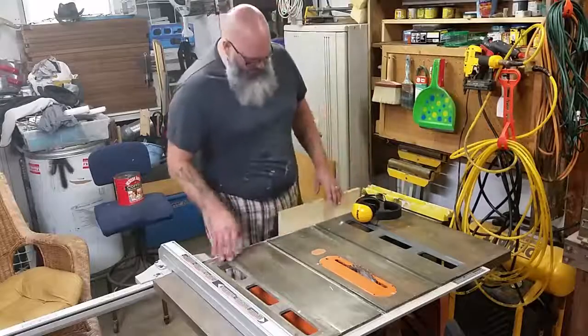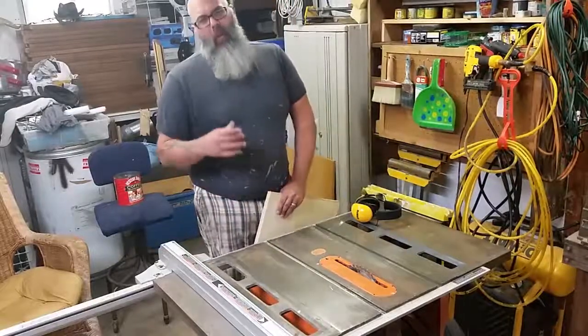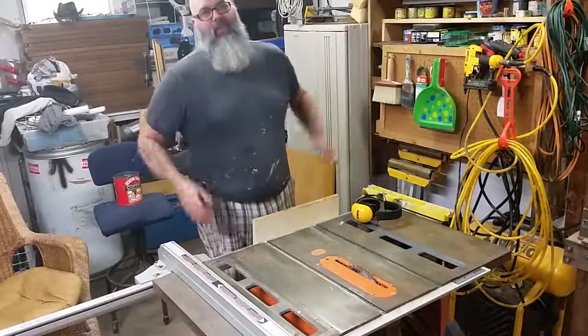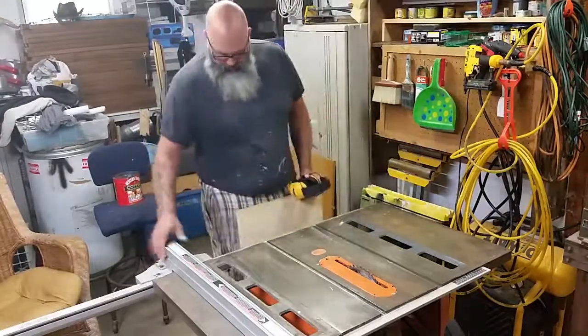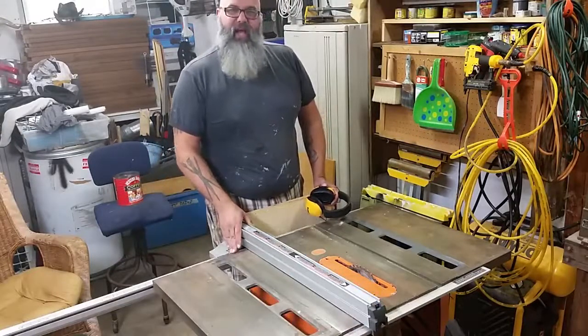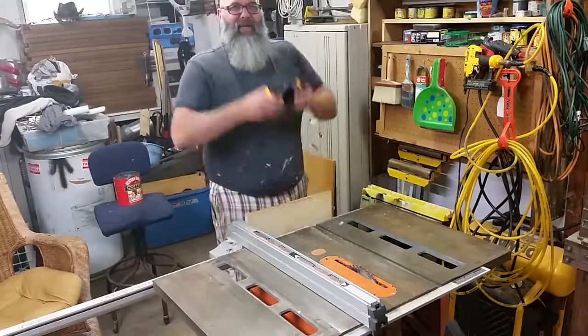Of the sled, I'm going to glue two pieces of 3/4 inch plywood together. I want it to be a little thicker, and I don't have anything that thick of solid wood. We'll see if that works. I'll set my fence to 6 inches for the first cut and about 3 inches on the second cut. More about that later.